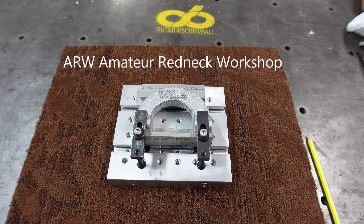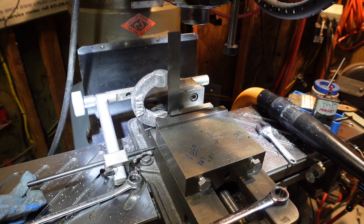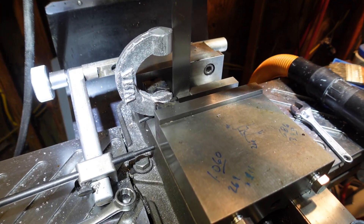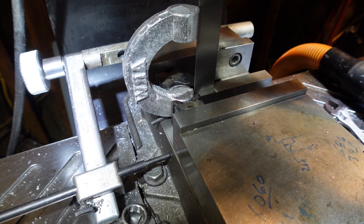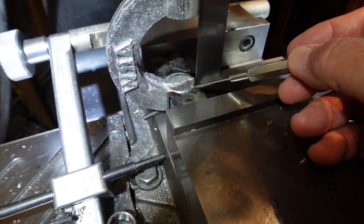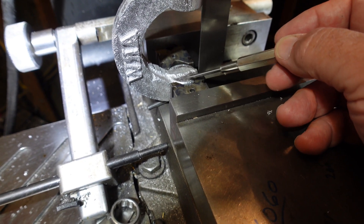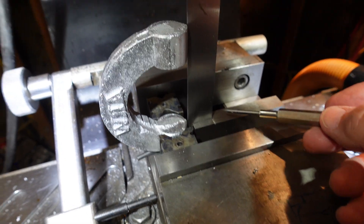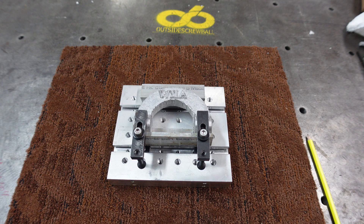This is the first piece I thought we'd talk about. If you recall, in the first video I showed it set up vertically in the vise. This is a little handheld shot — I'm just looking at how I would machine this part, setting it up here in some v-blocks. The v-blocks are not touching the flat; they're on the radius of the circumference. With a square, you can see I've got the unit sitting pretty square between some angle blocks — that was kind of a tease.